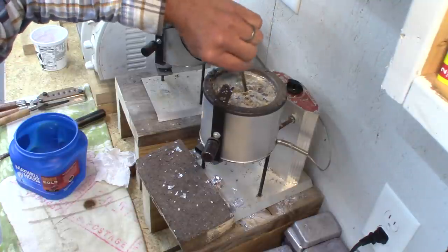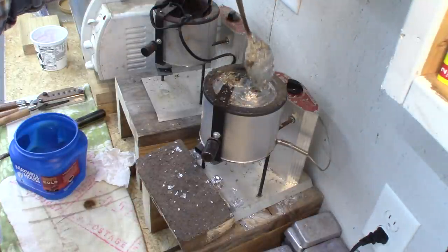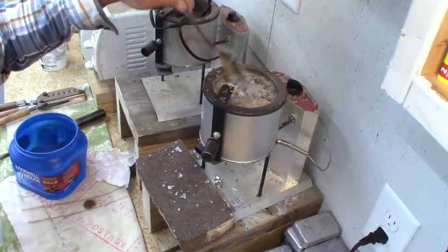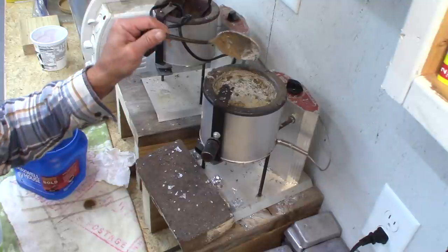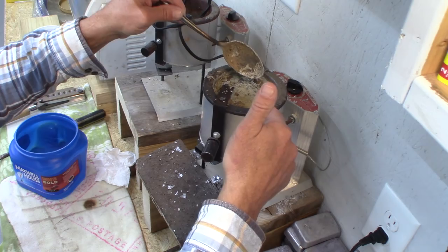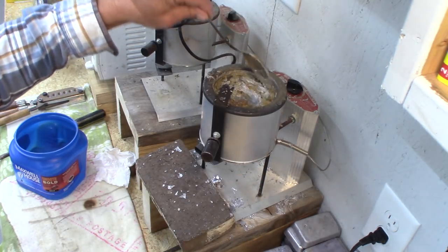What we do is scrape this pot and get all of the impurities off just by scraping it out — very simply, you don't have to go into a lot of detail, it's not that complicated. When you get the material at the top, there are a couple of ways. Some of us like to use candle wax; the candle wax will drop in and usually light up and catch on fire, but the whole idea is to use carbon to flux the pot.